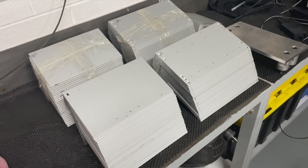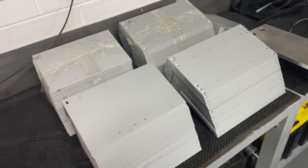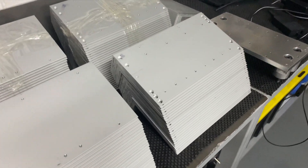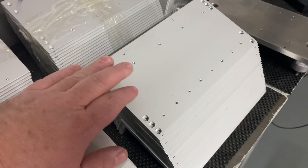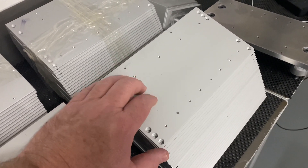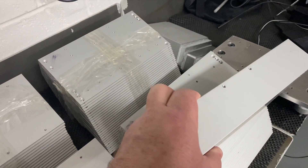So this fixture plate that I'm doing — let me bring the camera around and show you what I'm actually making. These are for Mark from Phase Change Converters and they're heat sink angle plates that go inside the three phase rotary phase converters. They've got to have precise holes drilled in a precise location and tapped, so predominantly there's M3 and M4 tapped holes, and the tricky ones were these two tapped holes on the end here.